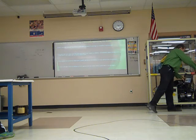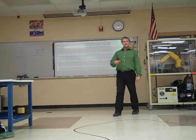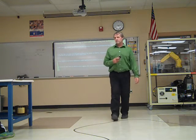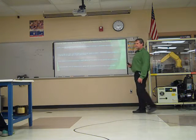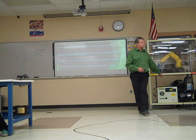Okay? From a safety standpoint, that's pretty darn important. Because you're running it and somebody else does something stupid and you smack them with the robot. Not a good thing. Okay? The only person allowed in there is the guy that has the teach pendant. And that's only if it's in teach mode, when you have that in T1.